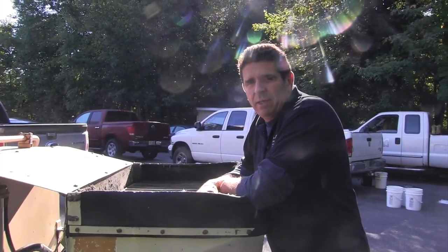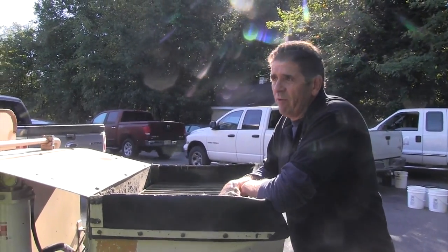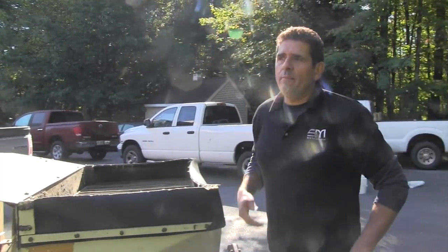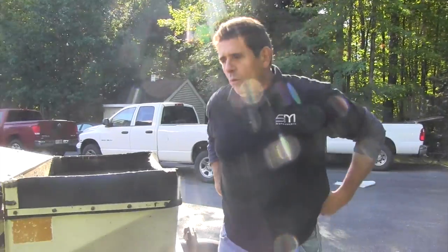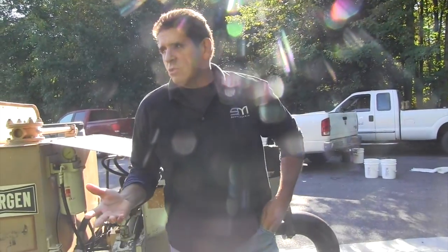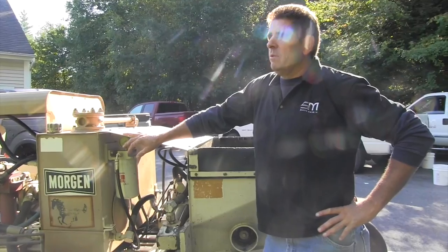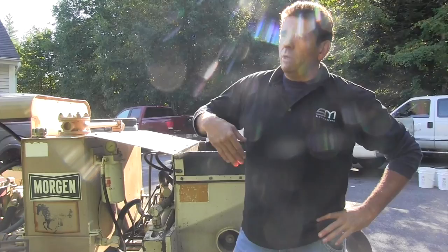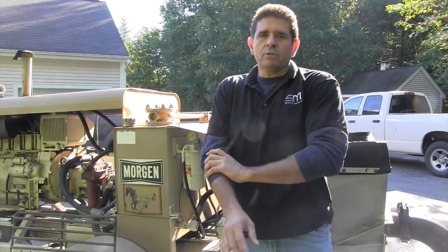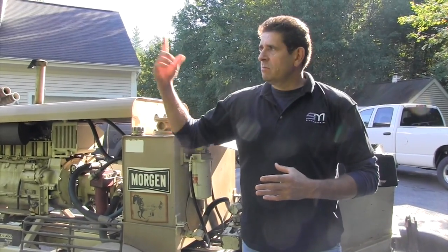This is a line pump. And with the line pump, when you get out to 130 feet, it becomes a little hard to push, especially when it's a drier mix. You know, for wall mixes, it's harder to push that stuff through because it's drier. But there again, we put a little bit of stone in it just because we're pumping it. He's going to put in a slurry mix, which goes through here, kind of lubricates all the lines, and that way the rest of the concrete just kind of goes in there. And once you already have that slurry going in there, the whole thing just starts going all the way through.